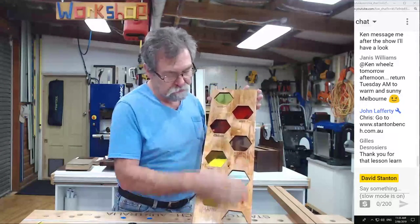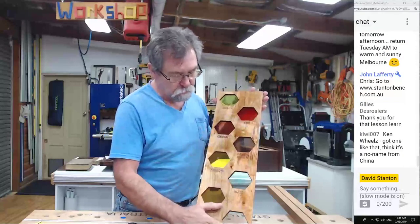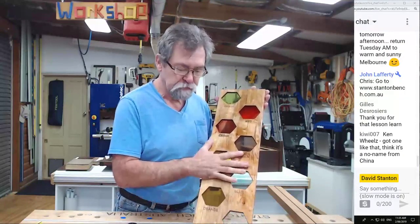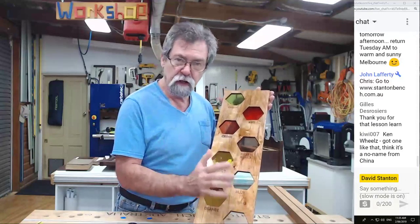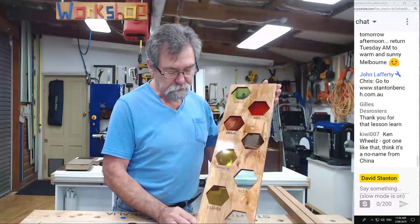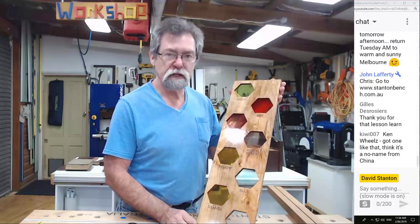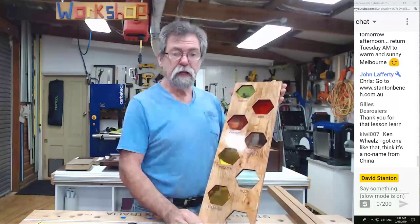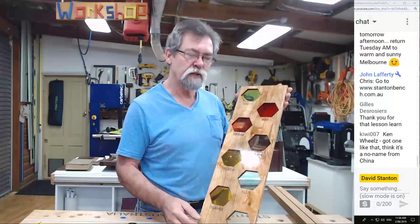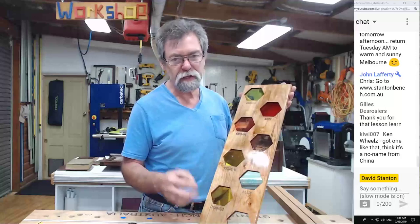One of the things that I knew but I didn't do was when you put a finish over the top. So this has had, I sanded this to 4,000 and then I finished with Liberon finishing oil. Now I know that Go Natural Timbers finishes theirs with Liberon Danish oil, or superior Danish oil. And I'm curious to see if anyone can get a satin finish where the resin still looks nice and attractive without being too opaque.